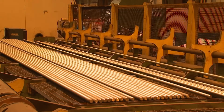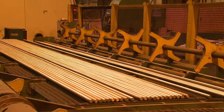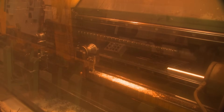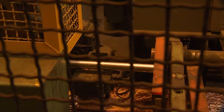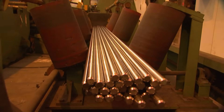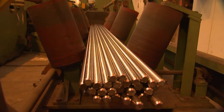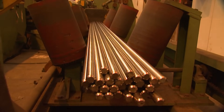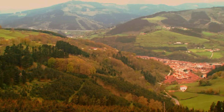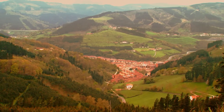Next, the steel bars undergo the peeling process that reduces the bar diameter from 2.5 inches to just under an inch. Then onto the straightening machine for minor corrections, and finally into a bundle to be delivered to the customer — in this case, a precision barrel manufacturer.